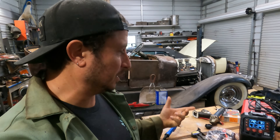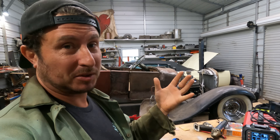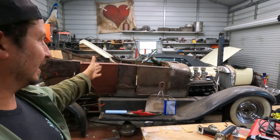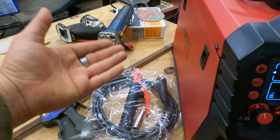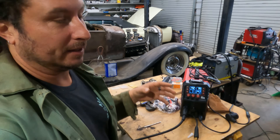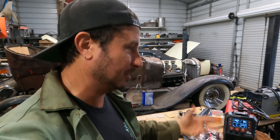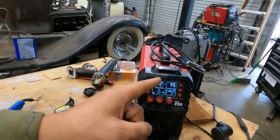This thing is marketed as a multi-process welder: gas MIG, flux core MIG, stick, scratch start TIG, and an aluminum spool gun option. For me, I'd buy this machine to MIG weld steel — everything from chassis work to sheet metal work. Stick welding comes with the lead included. Scratch start TIG and the aluminum spool gun require purchasing additional setups. It also says it can push aluminum, but no MIG machine can really push aluminum well, and you'd want a Teflon liner for the gun.